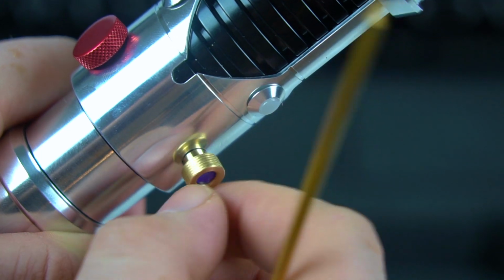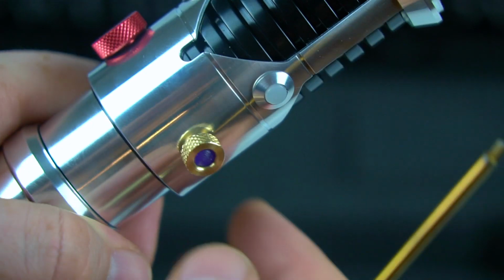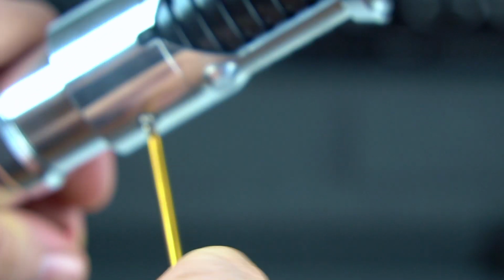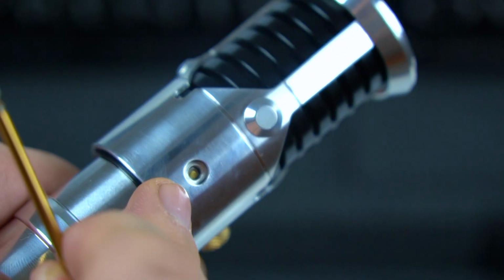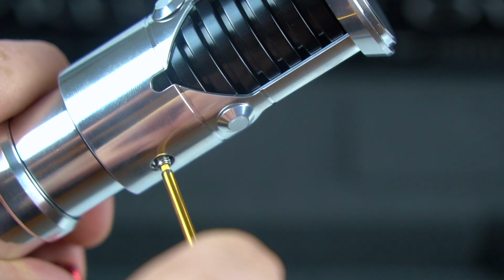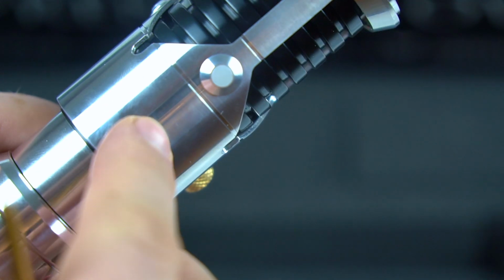Not too much, you don't want to glue anything down. And then once it stops, so there it stops, you want to be very delicate, and then that's your switch. Same for the other side. So you take the other screw that's included. I'm just repeating the process. So I can see there I lined up my switch nicely. You can see the gold actuator of the switch PCB, and I'll just tighten that just until it stops moving.